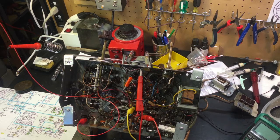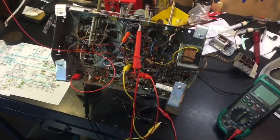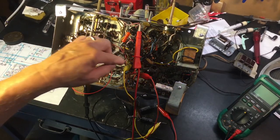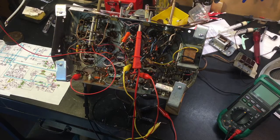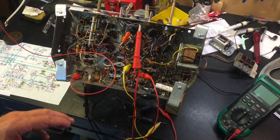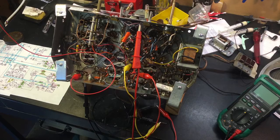Now this bit of business down here, which you really can't see, but under here, let me see if I can. Yeah, right here, it's dark in there. Right here I have a couple of electrolytics. I need to restuff this one electrolytic can. This one has 4 electrolytic capacitors, interestingly enough. So I'm working on that. So I put these down here to check out the radio. Don't do this unless you're, well, don't do this, period. I'm stupid, so I did it. But they're alligator clipped into where the other caps should be.